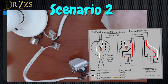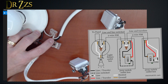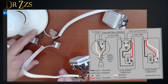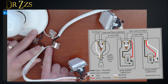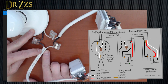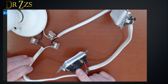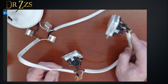In this three-way switch scenario, you've got power coming in from the circuit breaker going to the junction box where the light is in the ceiling. The neutral from the circuit breaker connects to the neutral for the light. The hot wire from the panel will connect to a white wire that's going out of the box and down to your first three-way switch — a good electrician would probably have some sort of black mark on it indicating it's carrying the hot side of the circuit. The black wire from the light also goes out of the box with the white. These two wires are what will go to the common poles on your three-way switches.